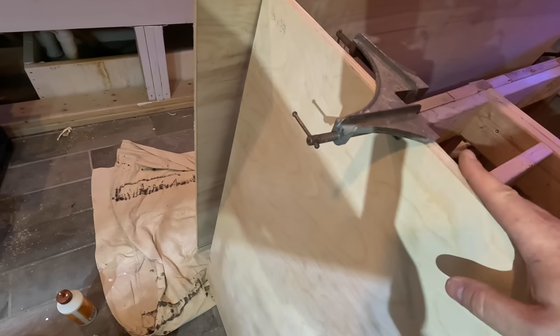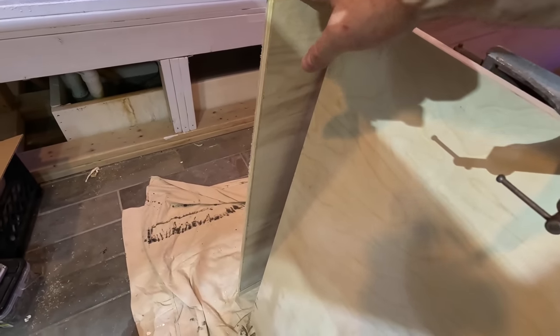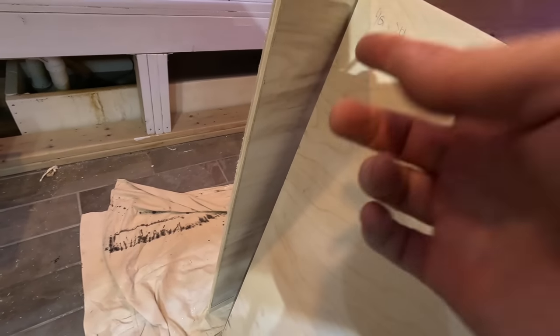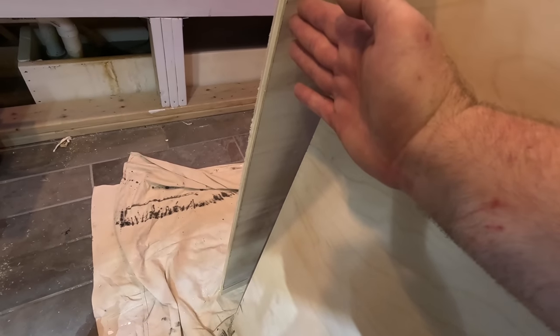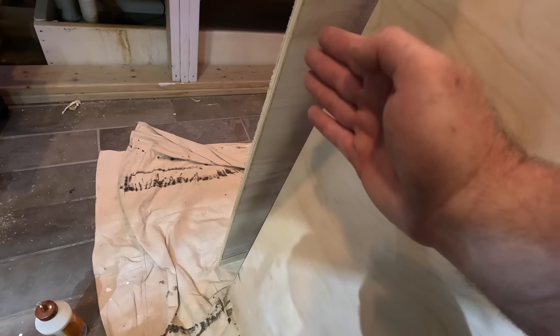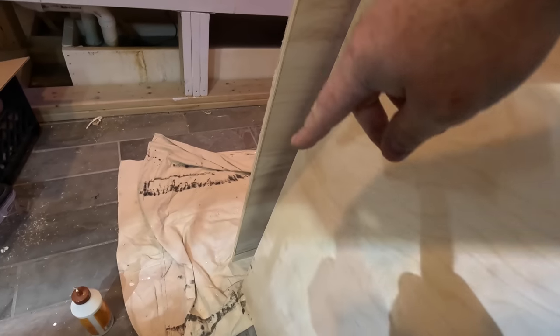What we've done is we've got the side positioned and taken down the mock-up boards. We've got the bottom — the base of the aquarium — over here and we're going to be doing it sideways, connecting them like this. First step: get the boards positioned, get the clamps all ready. Then we're going to put the glue along the bottom board, move the sideboard into place onto the glue, get it clamped up, get a screw in there at the top, get down to the bottom, get that clamped up, get a screw in there, then get the middle lined up and get a screw in while the glue is still not set. Get the top corner, get the bottom, then get the middle, then come back and put all the screws in.